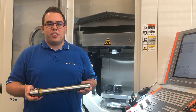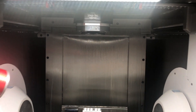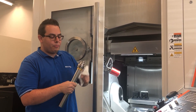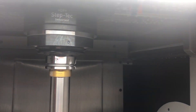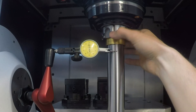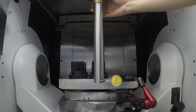Now I will show you how to use the MasterBar. The first thing to do is to clean the tool spindle. After that, the test arbor must be cleaned and clamped into the tool spindle. Place a dial indicator on top of the arbor and turn the MasterBar by hand to check the runout. Repeat it at the end of the test arbor.